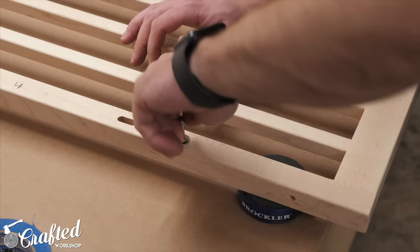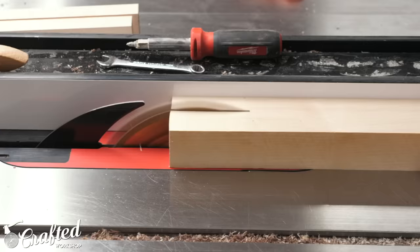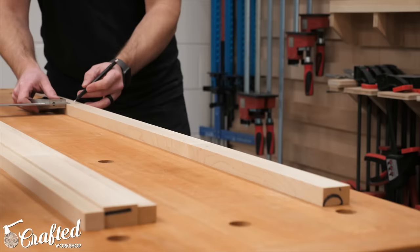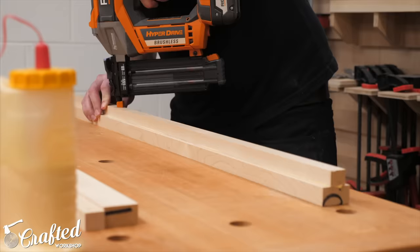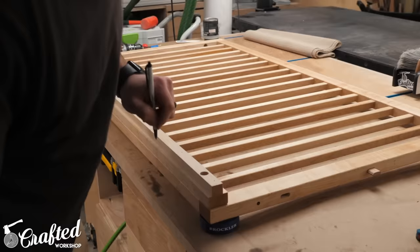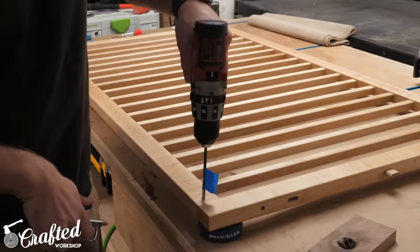The last pieces to create for the crib were the mattress supports, which are really simple. The mattress support rails are made up of two pieces of hard maple, which I cut to rough size at the table saw and then milled down to final size on the jointer and planer. The two support rail pieces are glued together to form a little ledge for the mattress slats to sit in, which keeps the slats from moving around or falling off. Once the glue dried, I drilled a recessed hole for another stainless steel bolt using a Forstner bit for the recess and a twist bit for the through hole. I decided on the mattress support height, marked where the holes would go on the sides of the crib, then drilled and tapped the holes. I only added hole locations for two mattress heights but can always add more later.